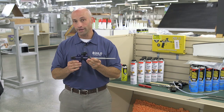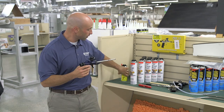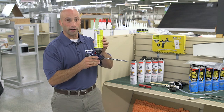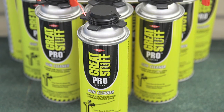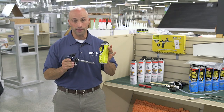After about every two to three cases of foam, you can take your can of cleaner, actually screw it onto the gun, and run through about a third of a can to really flush out the barrel. You don't want to do that too often though, because the cleaner is corrosive and will eventually lessen the life of your gun.